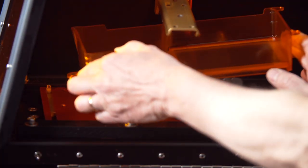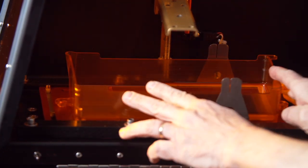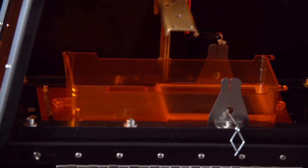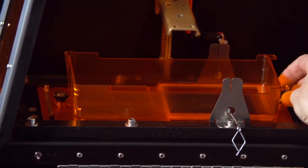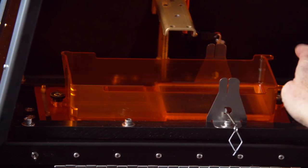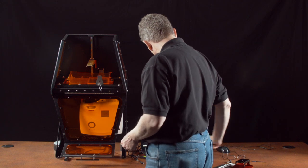Notice that the window side is on the right and the spout side is on the left. We'll maneuver it in over top of the supports for the sweeper and then slide it around until all four feet engage the slots. Then take these small thumb screws, one on each side, and don't over-tighten these — just until they're gently snug. If you over-tighten them, you might put stresses on the VAT that you really don't want.